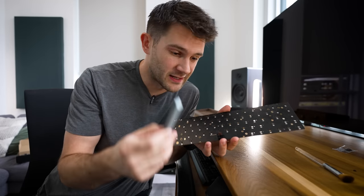So from what I understand, it's best to do a couple of key switches around the perimeter of your plate and then worry about filling the rest in afterwards once you've got those pressed into the board. So let's do the corners like so. Okay, let's see if we can get those guys to slot in nicely. There, that goes in there, that goes in there. Those ones go in, okay, so there we go. There's a plate, now let's populate the rest of these switches.